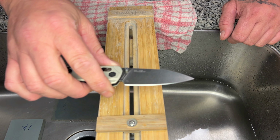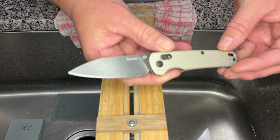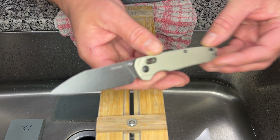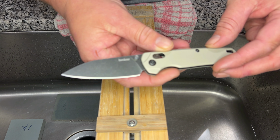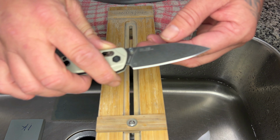He asked me to even out the bevels, but from what I've seen, they look pretty even already. I put them on my edge tester, and they both come out to 20, I think it was 20 or 22 degrees per side. Almost dead nut center.